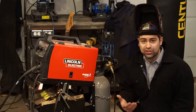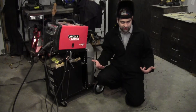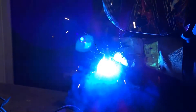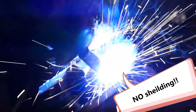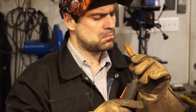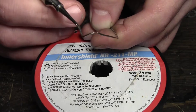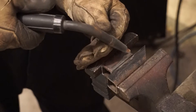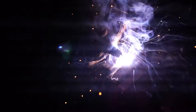The first question that most people will usually have when they start looking at welders is: what is the difference between flux core and MIG, and which one should I really be doing? When you weld, you are essentially heating metals and melting them together. The biggest difference between MIG and flux core is the method used to protect the metal being welded. This is called shielding. Without shielding, oxygen and contaminants in the air would compromise the weld and produce a poor and very weak result. In MIG welding, your welding gun basically shoots a continuous flow of gas that blows away and replaces the air around your weld. Whereas in flux core welding, there is no gas. Instead, there is a material embedded into the core of the wire that when burnt by the heat of the process creates a fluxing effect and also produces shielding gas, which emits itself out of the metal to protect that weld from the air.